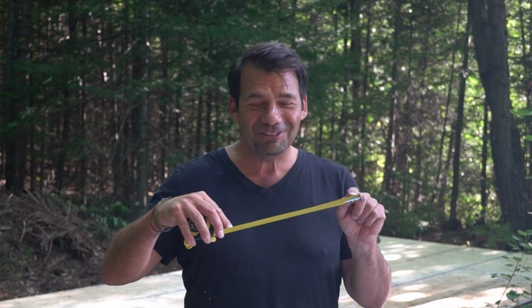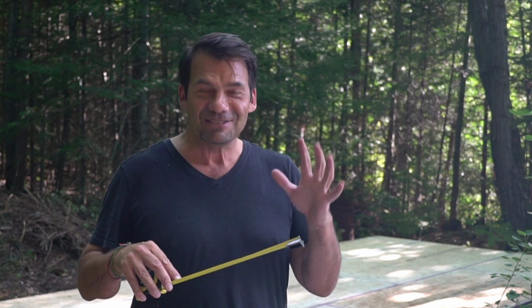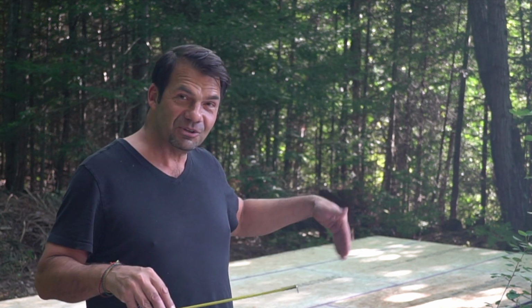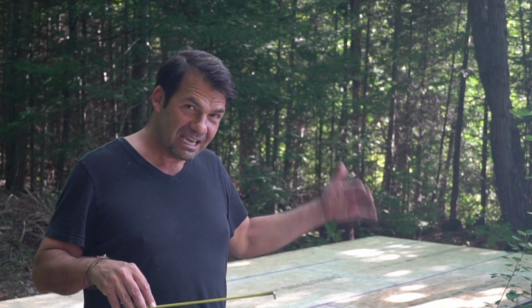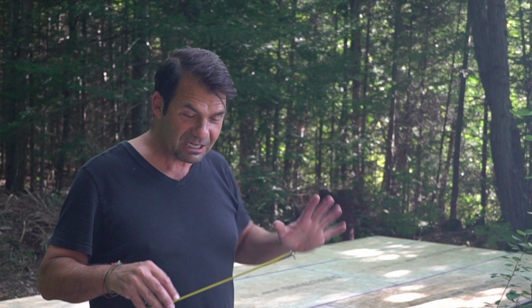When it went to adding the floor joists, this was critical, a tape measure. And all those little measurements on this tape measure are so important. You might want to have a pad of paper or something to keep writing them down, keeping track of them as we measured. And that was also important when we did the first couple of the 4, the 8, the 12, and the 16-foot floor joists running in the other direction. Having the right measurements and someone to hang them with me was really great.